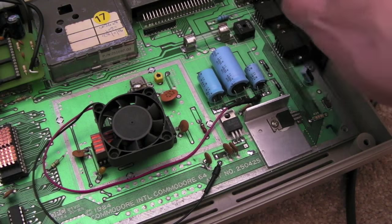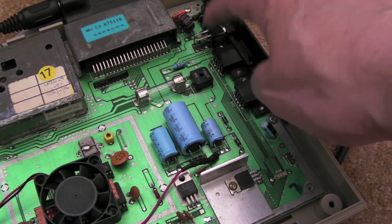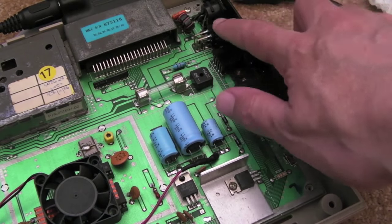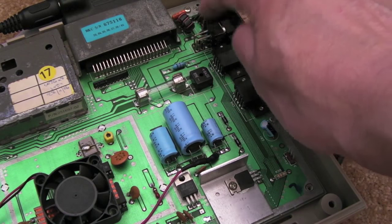So there's a lot to be said about the switch — it wasn't really the socket in this case, it was more the switch. I'll put a link down below. Check out Boak's video. He removed this switch, disassembled it, cleaned it all up, got rid of any oxidization, re-greased it, reassembled it. Fantastic — that is a good video to watch, and I'll be doing that on this.